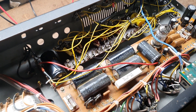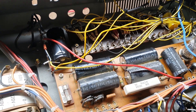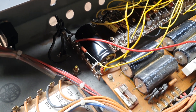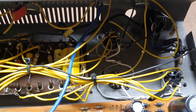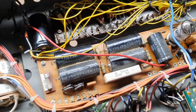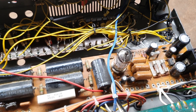The amp is now nearly completed — a lot has happened since I last left you. I went with a different type of board, a slim profile board, mainly to save space and because that's what I had available — I didn't want to wait for new parts. As you can see: the input tube, distortion tube, cathode follower — and this board here is all stock from the Roland Bolt power amp, which sounds really good. It's very clean — their take on the Music Man kind of thing.